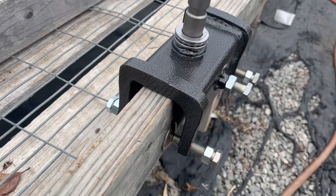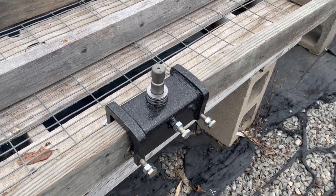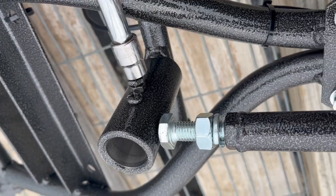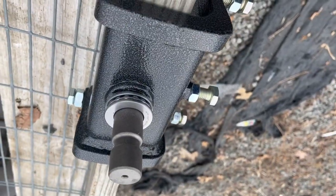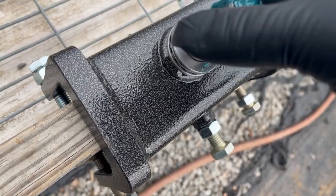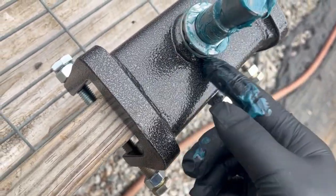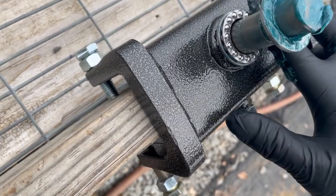Now I have my impromptu motor stand set up. Next I'm going to put the bottom bracket on that the motor mounts to. First you undo a little Phillips screw and a 10 millimeter bolt - the rule is pretty much always 10 millimeter for this kind of stuff. Loosen those enough so you can put it on the shaft, and before putting it on I'm going to apply some marine grade grease to make sure the bearing stays happy and doesn't pick up grit.